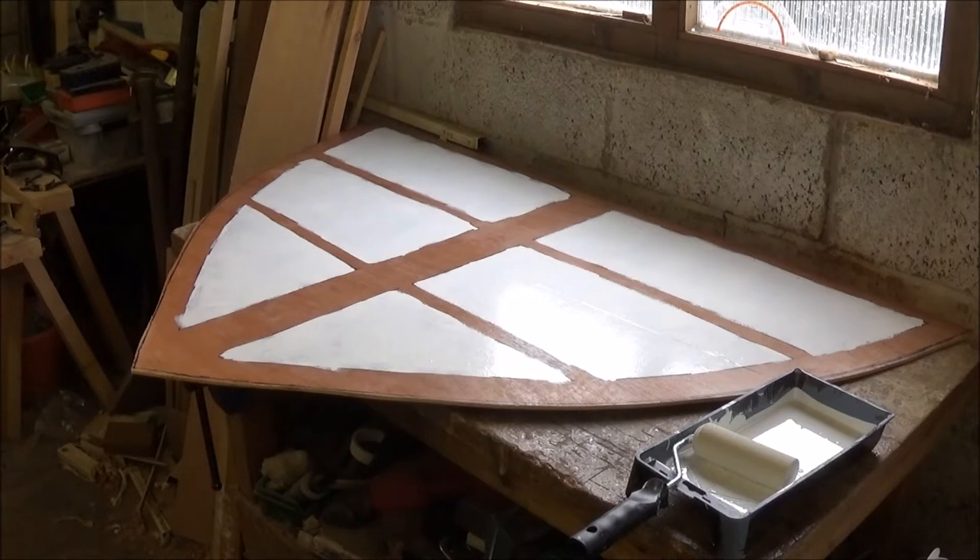I did that this morning, rubbed it back with some acetone, and then I've put on some of that white bilge paint. I've also put some on the underside of the king plank just to seal that in. I think most of it I did with epoxy coat anyway, but it's just a little extra on the underside. So I've got to wait for that to dry now and then I'm going to bite the bullet and actually stick it on today. Then I'm going to come back and glue it all on.